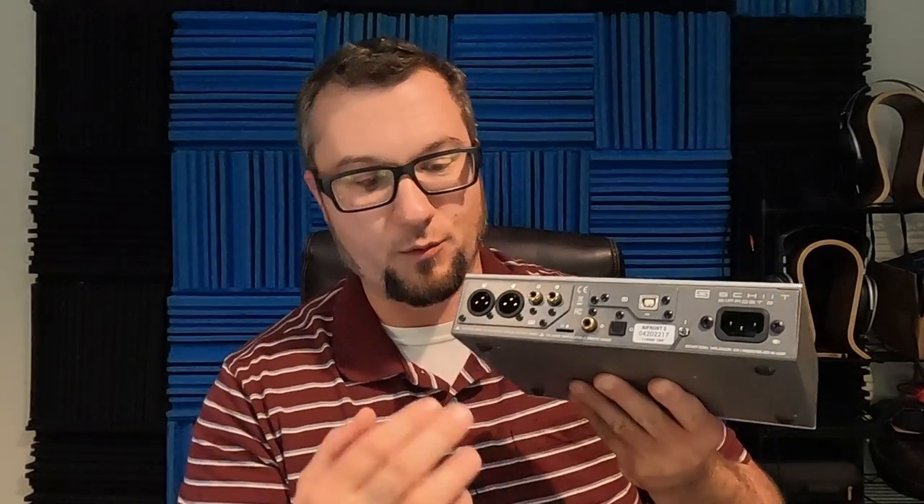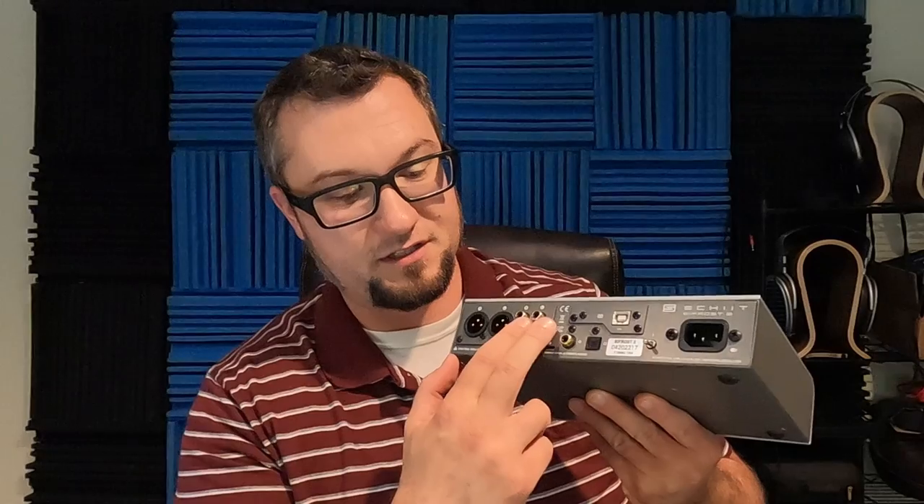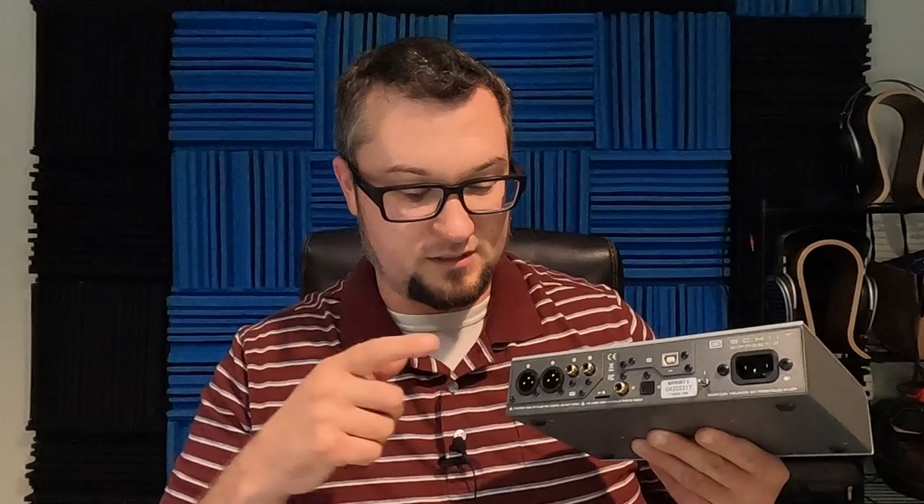It's still the Bifrost 2 really — the changes are in the DAC module, where we have the balanced XLR and single-ended RCA outputs. This new DAC module uses Texas Instruments multi-bit chips, which is a resistor ladder R2R on a microchip, whereas the older version used similar multi-bit chips from Analog Devices. The move was mostly due to supply reasons. The hardware change also squeezes out an extra bit — going from 16-bit to 17-bit resolution.